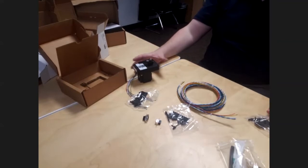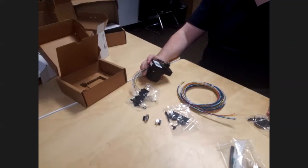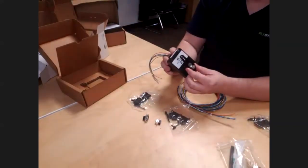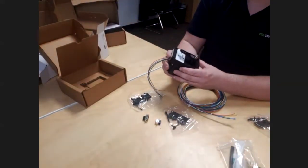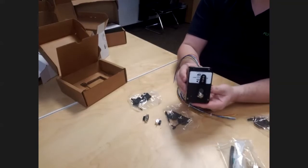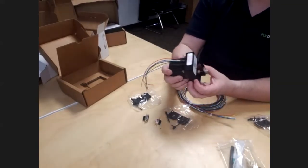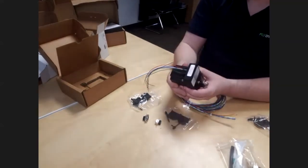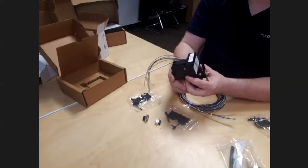There's also, I think you mentioned it, another style of servo that employs a capstan, or essentially a pulley with a bridle cable and clamps, for aircraft like the one some of us at Dynon share, the Glass Air Sportsman, which has cables and not push rods for many of the controls. But for most of, let's say, the RVers, the vast majority of people, you're going to be using the servo like you see here that has the push rod with the arm.